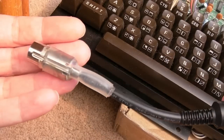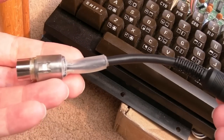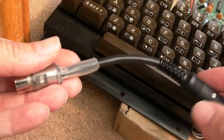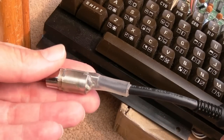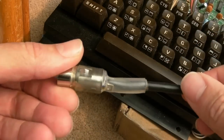So I'm adding this bit at the end, I didn't explain that very well. What was happening is there was a black screen. I measured the voltage, the main 5 volts was missing. We had the 5 and the 12 that go to the VIC, those were there, the ones on the two regulators on board. But the main 5 volts was missing. At the same time, I could smell something baking and unplug this. And this was really hot. And I was like, why is this hot? Has this failed?